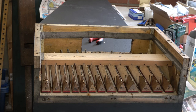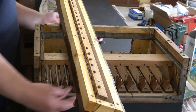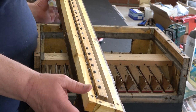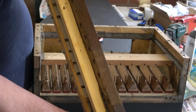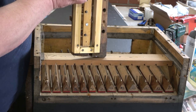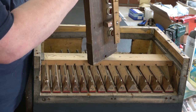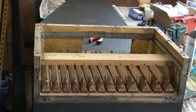What I didn't show is what I've actually spent three weeks doing — the touch box. We've modified this dramatically. The springs that were in it have been changed to the type we can get and adjust, so we've had to expand the depth of the well of this to take the different works. We've now got these pieces of black-leaded dowelling going through a register — it's the original register but expanded to take the dowelling — and now they work and return. A lot of time has gone into it.